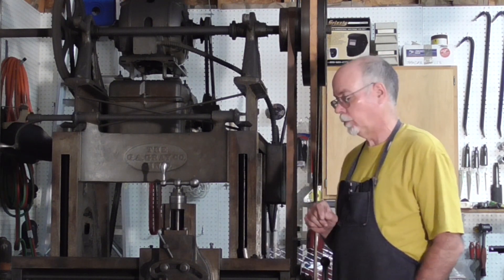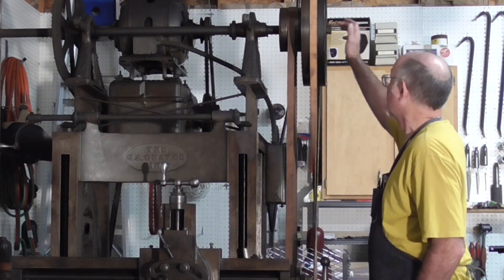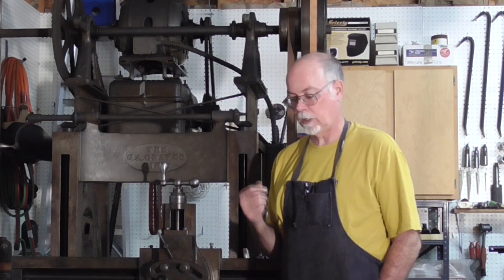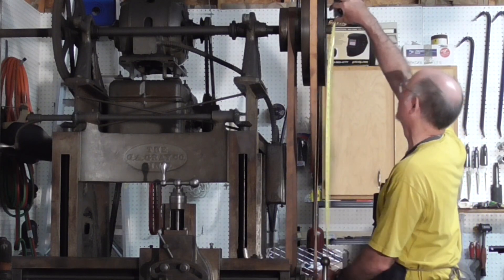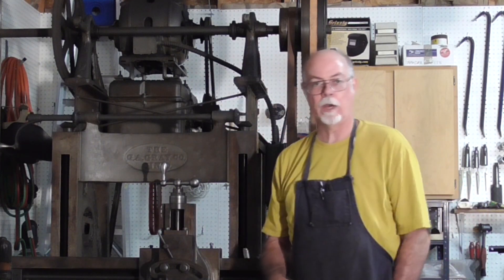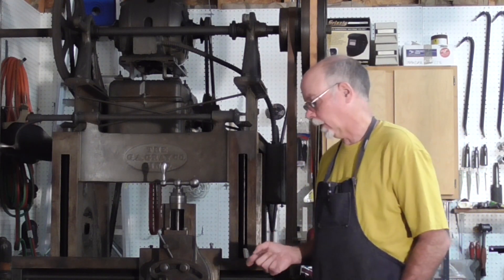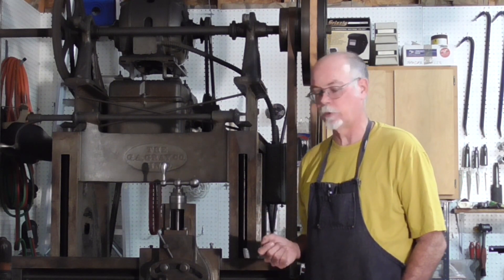This pulley is above the other one, so there's a factor that goes in. The distance between them measures five feet, giving a factor of 0.65. And because the belts are shifting back and forth, there's another factor — about 0.6 for a shock reversing load.